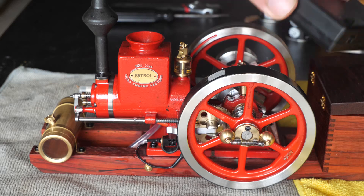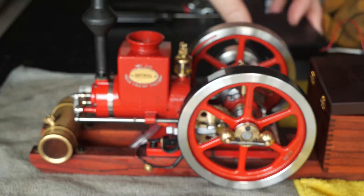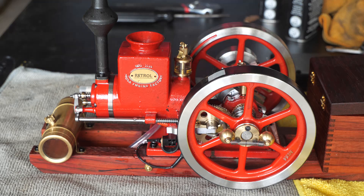So I switched the pack up. This is now a four double-A pack with rechargeable batteries in it, and that added an on/off switch, but it doesn't fit in the box anymore. With four batteries at six volts, we have spark again. This is just another reminder — always run your ignition units at the minimum voltage you can make them operate.